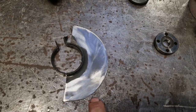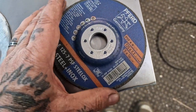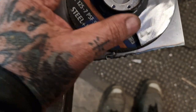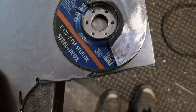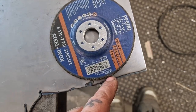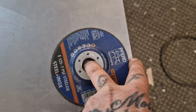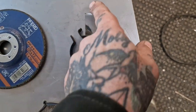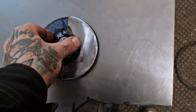Okay, so that's cleaned up. I was thinking of making just a slice, a little bit wider. I've traced around that and traced around the big one - the one that needs to go inside it. Place that on there and we're not far off, there's a bit of clearance so you could almost get a 5-inch in there and we only need a little bit. I'll follow the outline with a marker pen so it's clearer and cut to the outside of the marker pen, that will give us more clearance. Or setting up some dividers at 5.5 inch plus a bit, centre-popping and scratching the line. Instead of trying to do a little slice, just do any shape and weld it on the back. Don't matter - it's not going in a show, it's just to stop me chopping my fingers off.